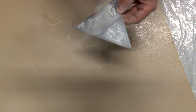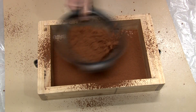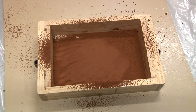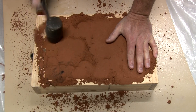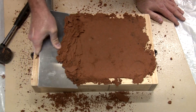There are quite a few things going against me on the sand casting, and we're going to try and work them out and see how far we get. So stick with me — let's go pound some sand. It's business as usual, putting the baby powder on the board and putting talcum powder on the part, really trying to get that talcum powder in there. Now I'm laying the facing sand, and watch — this is where I'm going to run into my first problem. And there I go — I cracked the sand. We're going to see what happens when you crack the sand and think you can just put sand back down and keep going, because it actually does create a problem.